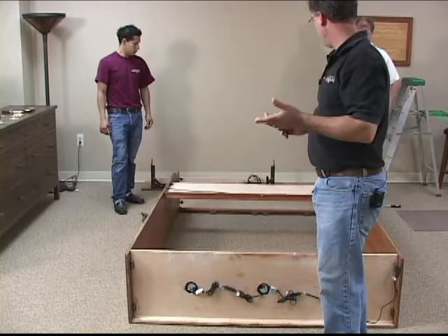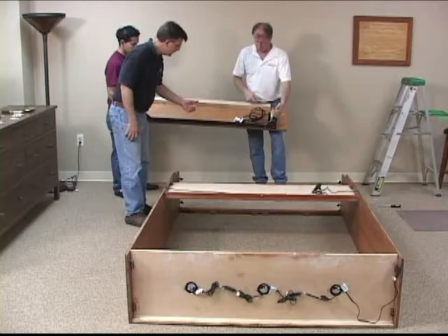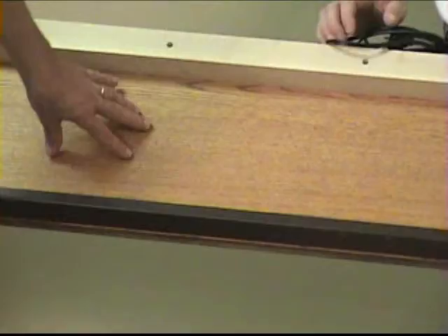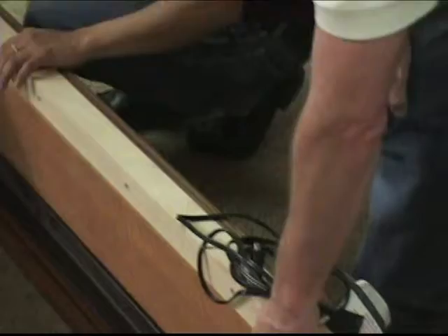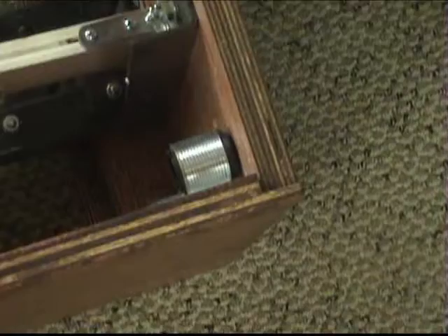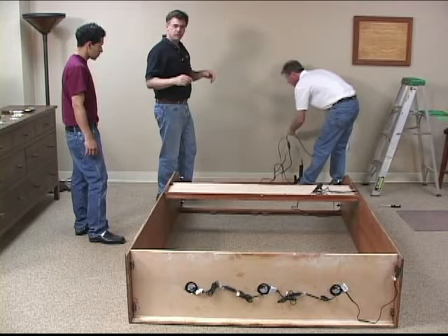The cabinet is actually ready to be stood up. The bottom of the cabinet has a subfloor — this is what holds the metal mechanism and transitions it into the case itself. Down here we have a route and that subfloor falls right into that route very simply. The leveling feet are designed to adjust the rack or handle any irregularities in the floor. We're going to stand it up and set it on the subfloor, and then show you a couple things about leveling the case. Try not to pinch the wires when you stand the case up — stand it nice and even, don't let it rack.